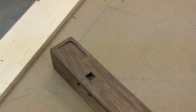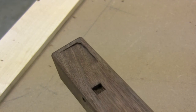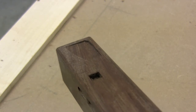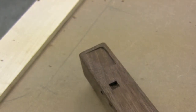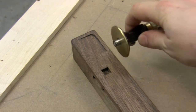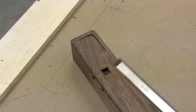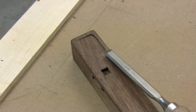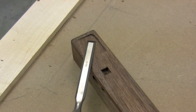Here's a close-up of the leg detail — you can see it's defined at the foot and along the edge, and it's actually slanted where it kind of tapers away, then gets deep in the corner, and then tapers away on the other side as well. I did these by hand; there were six total. I first defined the edges with a marking gauge along both the bottom and the side, then used a chisel to define the ends, the side, and the slant, then chiseled away the waste down into those corners.